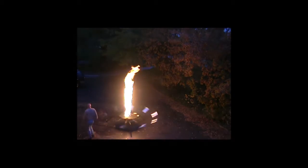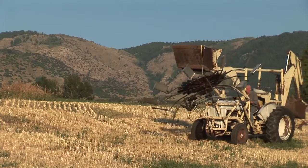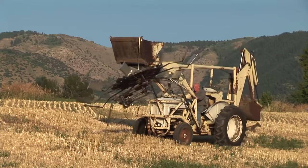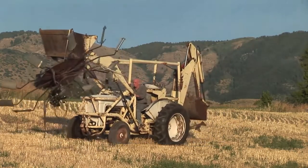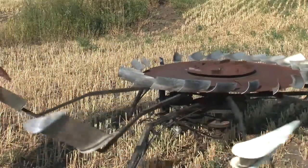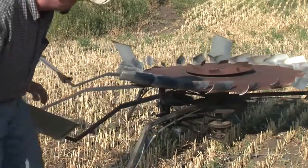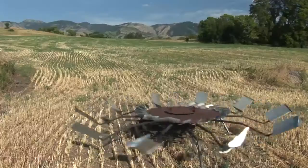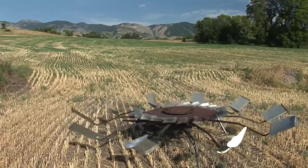I didn't make it very well, because it was a prototype, and so it's very dangerous, and parts may fly off at any given moment. So it's retired. The center section moves a lot faster than the outer section. This would go around about 43 RPM on the outer part and 400 in the inner part. And that's just how a vortex works. The air comes in slowly at the outside, and then at the very inside, it's spinning really rapidly. The center section allows the vortex to generate right from the center.